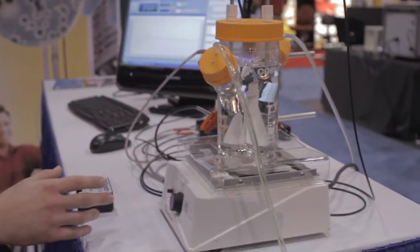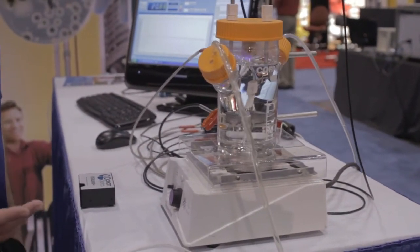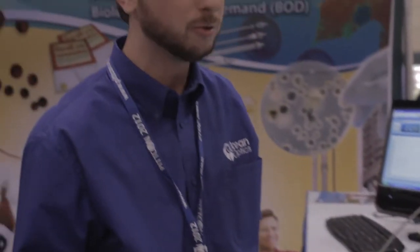The pH sensors work on a colorimetric basis — they use a dye embedded in a thin film, bromo-cresol green, that flips between yellow and blue depending on alkalinity, and what we do is correlate that to the pH level using our calibration buffers.